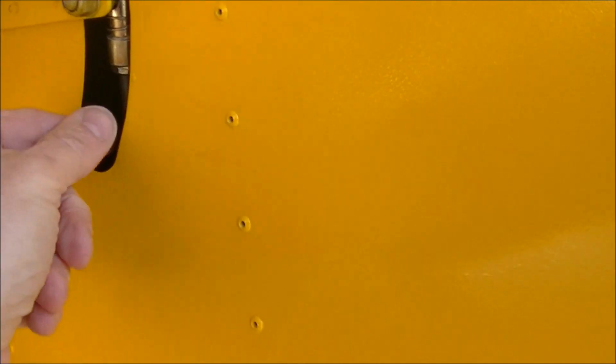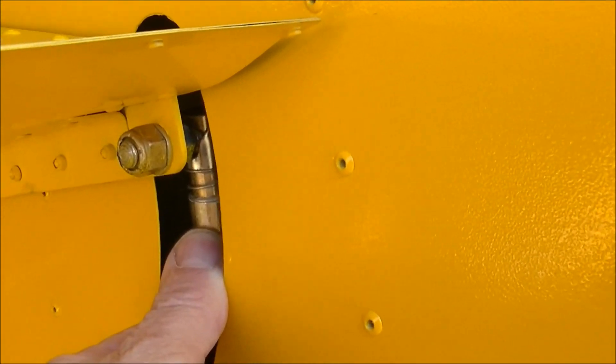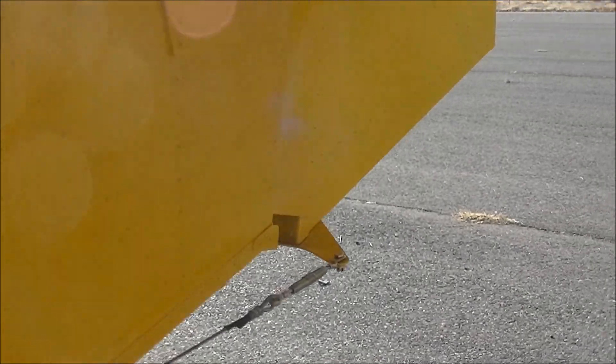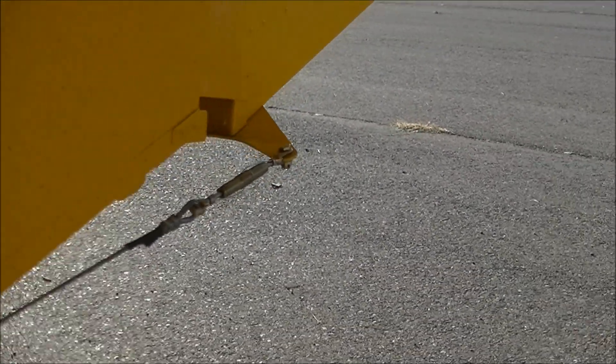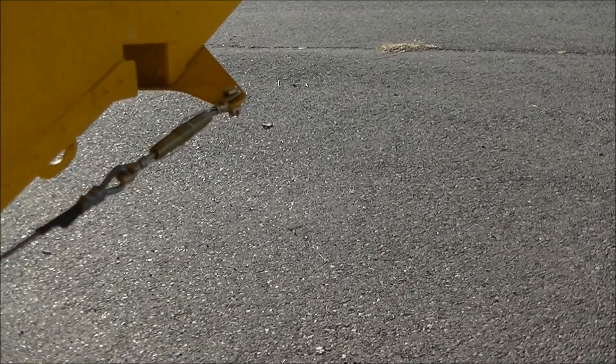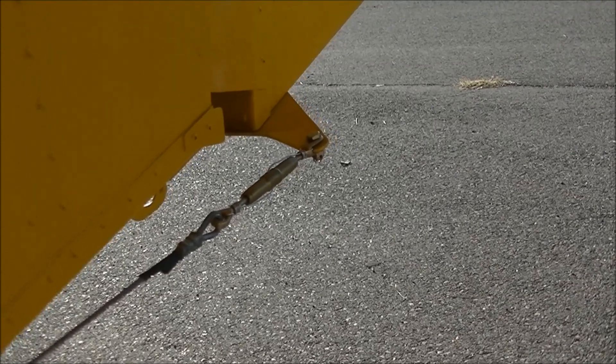You want to make sure you check the aileron quick disconnect and make sure it's properly secured — yes, it is. The rudder cables were a little bit loose, so Bob this morning undid the turnbuckles, unsafety wired them, and tightened up each turnbuckle about three turns to give a little more tension on the cables.